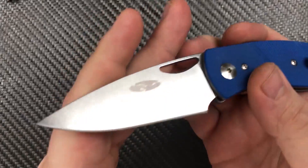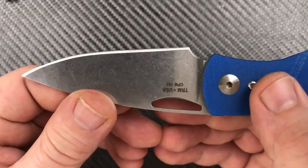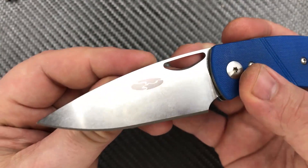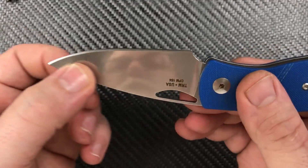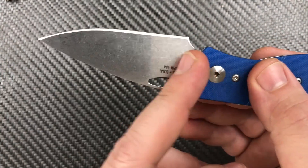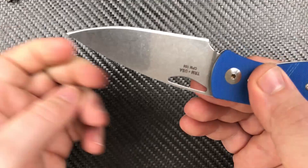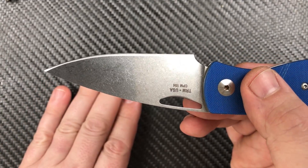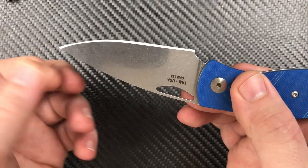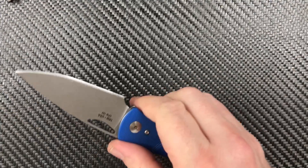Let's get a look at this blade. It is gorgeous — even though I fussed about it being just a little long, I love the finish. It is CPM 154, that's the Crucible Particle Metallurgy version of 154 CM. It is slightly more stain-resistant, holds an edge slightly better, and overall it's a better steel than 154 CM due to its manufacturing process. And the finish — it's a beautiful, almost mirror stonewash. As smooth as that finish is, it should put this knife way up in the stain-resistant category, because there's no place for corrosion to start except at the edge.